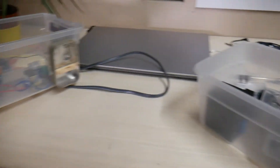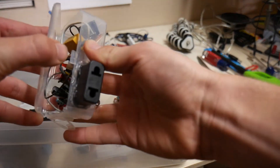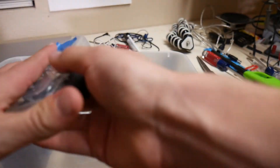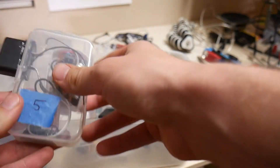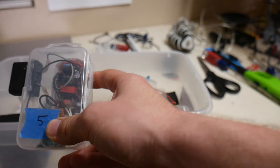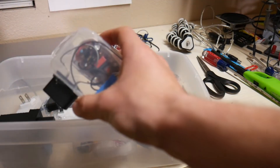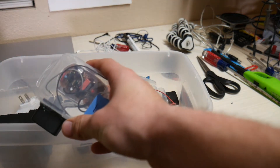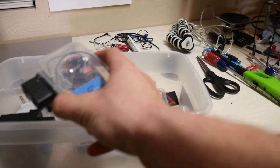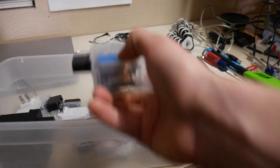Fast forward to the next year, and I made these little nodes that would individually turn on lights. You'd plug this into an extension cord and plug a light strand here. And from a 433 megahertz signal sent out by an Arduino base station, it would turn on different lights. This was pretty cool, but I left it out in the rain, and these are definitely not water resistant. So a lot of these burnt out.